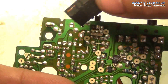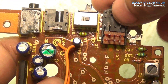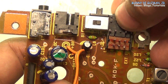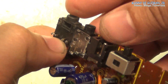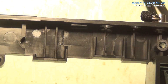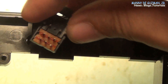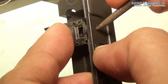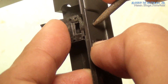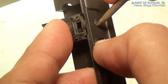The connector we need is a 3.5 millimeter stereo phone jack, commonly used to connect a headphone in MP3 players. It is the same size as the headphone jack on this RFP45, except the headphone jack in this radio is mono only. As you can see, the antenna port has not been drilled because it is intentionally omitted in this version of the RFP45. So I'll just drill a hole and cut some plastic to install and fit our missing connector jack.